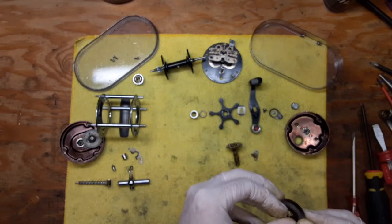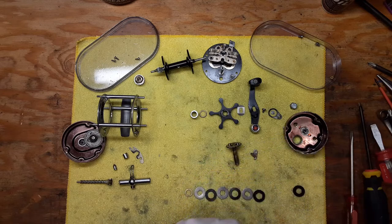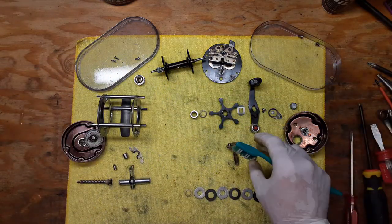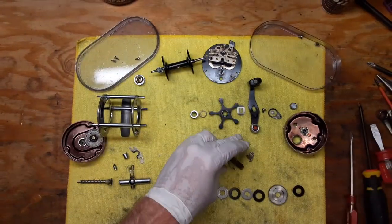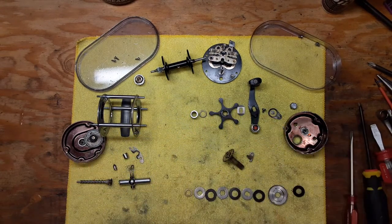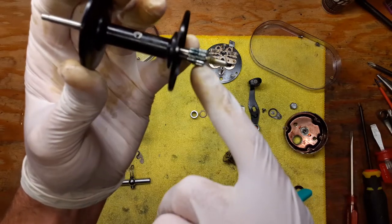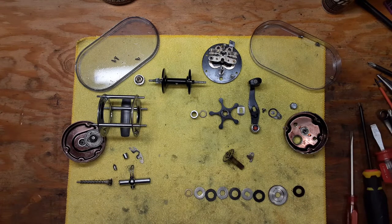There is a hard fiber washer hiding underneath the main gear. Then you've got your main gear — and once again: toothbrush, clean, penetrating oil — all these pieces and parts: the dog, the shaft, clean all these things out. Take a Q-tip to the inside of the housing of the shaft. With the spool, take some 4/0 steel wool and clean that shaft up really good. The teeth on the gear all need to be cleaned up. Once you do that, you're ready for reassembly. Thanks again for watching — this is Tony, we're back on the bench. If you like the video please give it a thumbs up, and if you'd like to see more please subscribe and hit that notification button.